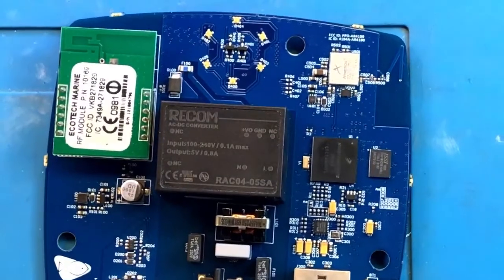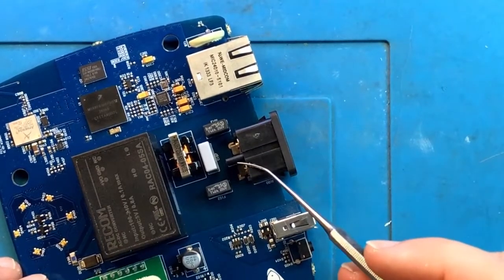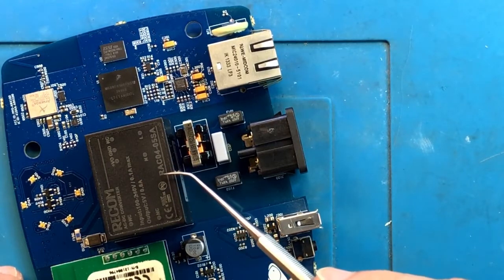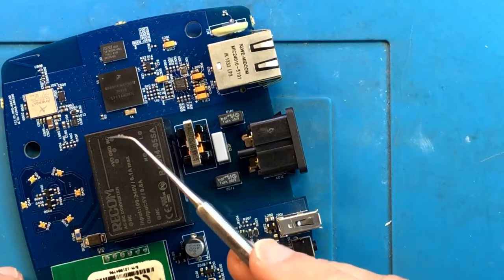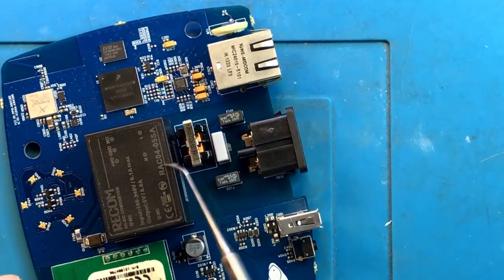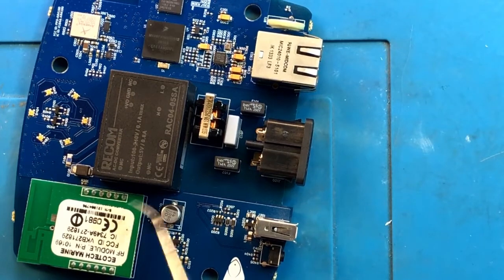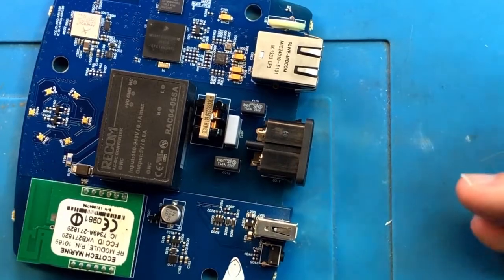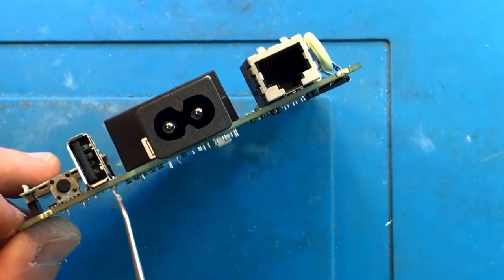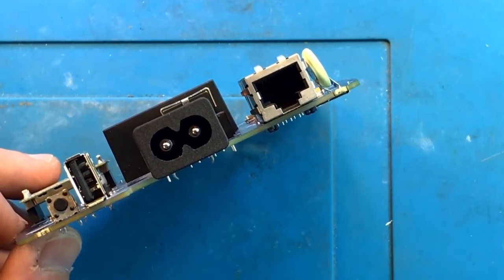Let's zoom in and see what we actually have here. Main AC power comes in, and there's going to be a converter from AC to DC. It appears this is a 5-volt, 0.8-amp converter. Unlike Neptune, somebody actually puts decent quality power supplies inside when they decide to have it on the inside of the unit. This is the typical RF module that you can find in all of the Ecotech lights — this model is probably from 2012 or 2013. On this side, other than power, we also have a USB port so you can connect it to your computer to program it, and a network port for more permanent connectivity with your lights.